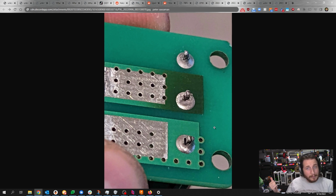Whether it's power out to the printer or power into the printer, you don't want cracked solder joints there. Honestly, these look like cold solder joints too. If you guys do want to see a tutorial on soldering, I am certainly not an expert, but I'll do my best. I've been soldering for well over a decade, and I still kind of suck at it, but I know a cold solder joint when I see one.